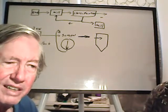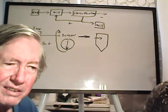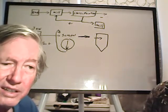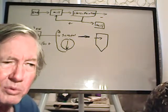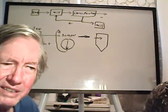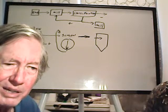Right now we're running 1350 watts at standard 110 or 120 volt line voltage. And that's 10.4 ohms. My calculations were that wattage at 120 volts should be 10.6 ohms. So that's pretty darn close to my calculation.